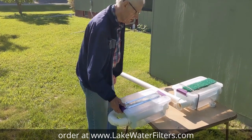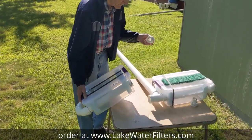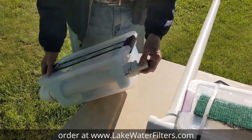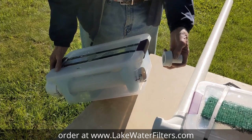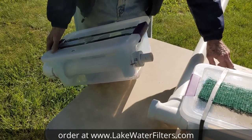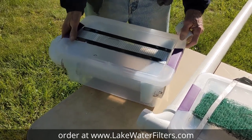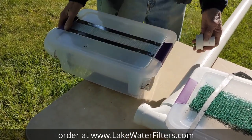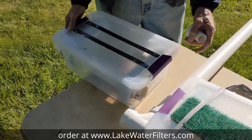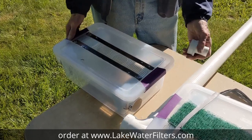The double is the one I sell the most, and I stick these on there if that's all you need. You can discard it. Most people have a 1-inch hose that goes on the end of that. Well, it's a 1-inch suction line. And then you'd put your check valve before that. Where? Well, if you've got a pump on the ground, you want to keep that prime to the pump, so you'd have to put a check valve ahead of the pump.